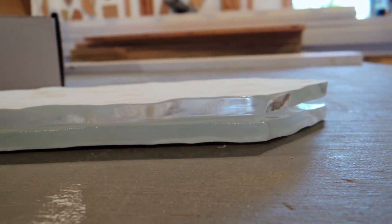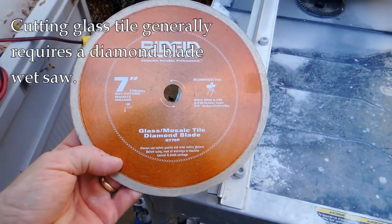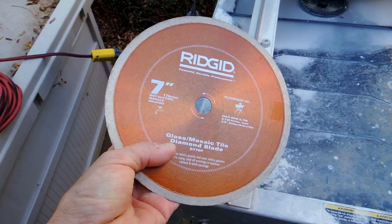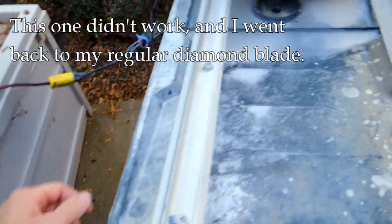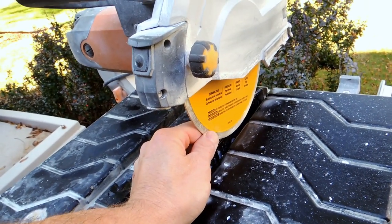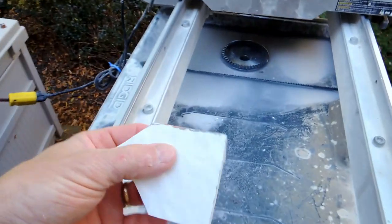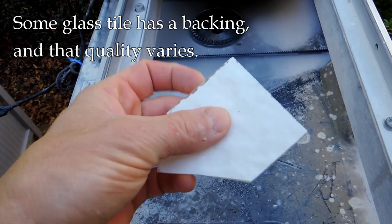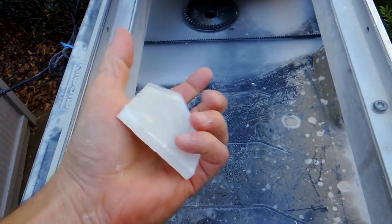I'm going to cut away to some comments I made on a job site and then we'll talk some more about this. So cutting this tile, you need a wet saw, generally speaking. I tried a new blade I'd never tried before — a glass and mosaic tile diamond blade. It was awful. I got halfway through one cut and threw it out. I'm just using a standard porcelain diamond blade and it works okay, but you have to expect chipping. To get around some of that, what you can do is cut upside down. A lot of this glass tile has a backing of some sort, but the front can chip as well. So if you cut it upside down, you have a better chance of making the front a clean cut.